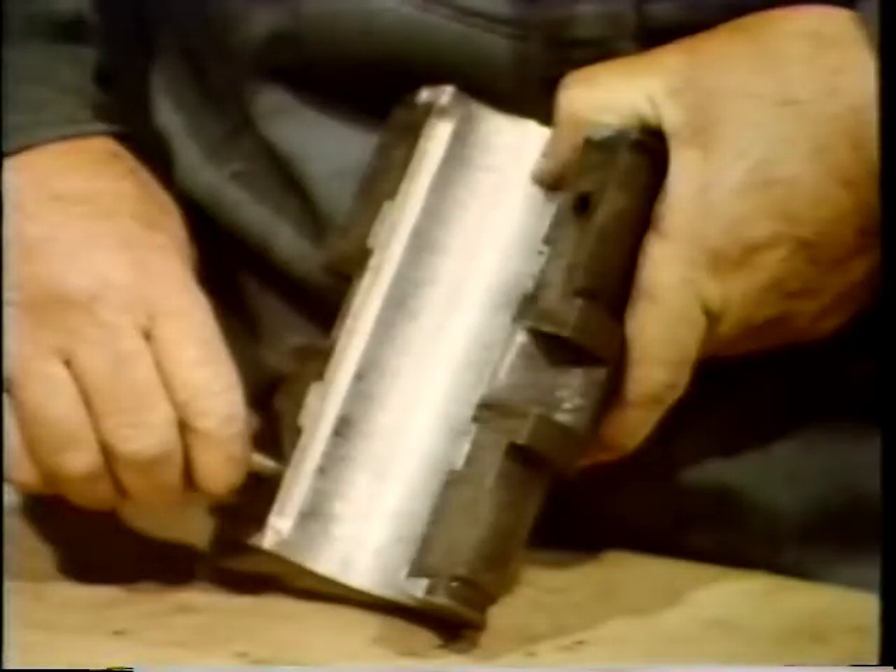While we took a break, our workman found the oil clearance to be acceptable. However, when he visually checked the bearing shells, he noticed indications of high spots in the lower bearing shell. This is where you expect to find high spots, since the shaft in a plain journal bearing is mainly supported by the lower rather than the upper bearing shell. So he's preparing to perform a contact check between the bearing journal and the lower shell. The results will allow him to determine whether there are high spots and check the alignment of the bearing with the shaft of the pump. Let's join him down at the pump and see how this procedure is performed.